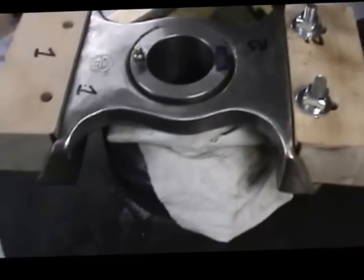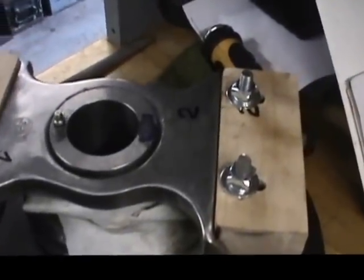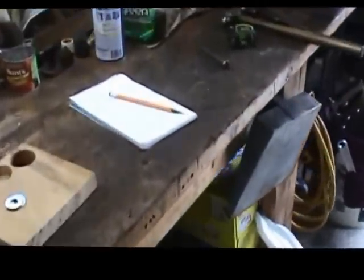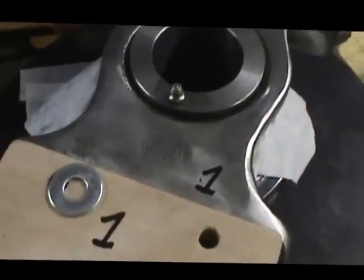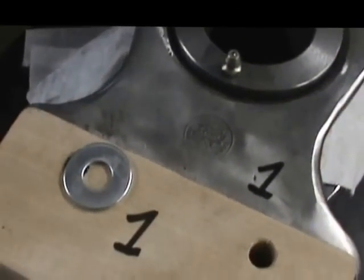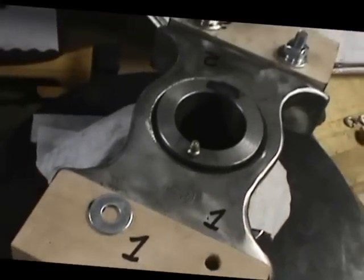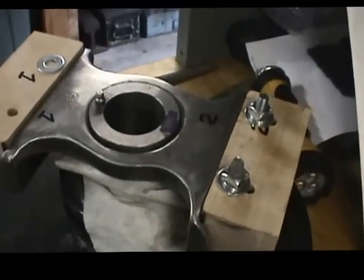So I've used 3/8 carriage bolts. I'm also using a flat washer with a lock washer and square nuts. The flat washers that are going to go on in this manner, I'm taking a chisel and making a small cut in the OD to raise some metal against the back side that will bite into the wood so that the lock washer will get a bite on the washer and it won't turn during running. So there was a little screw up, but you know, all projects have their learning curve.